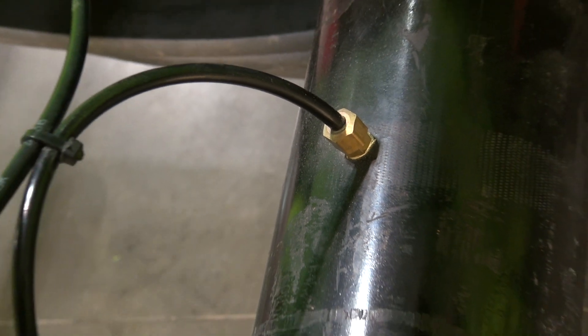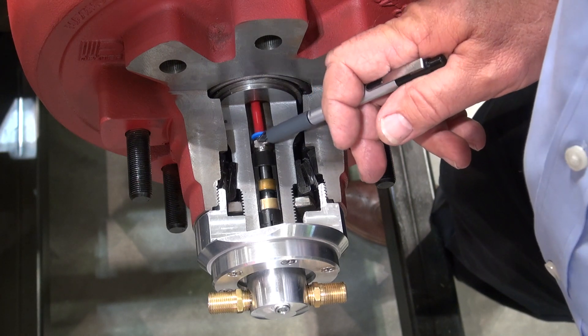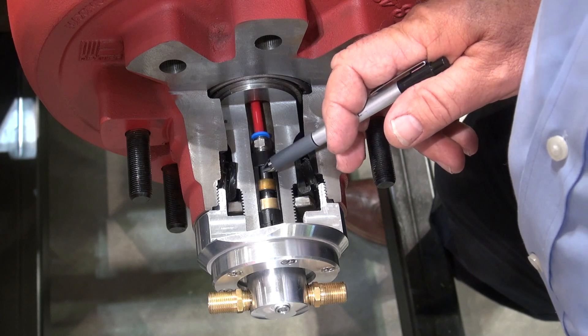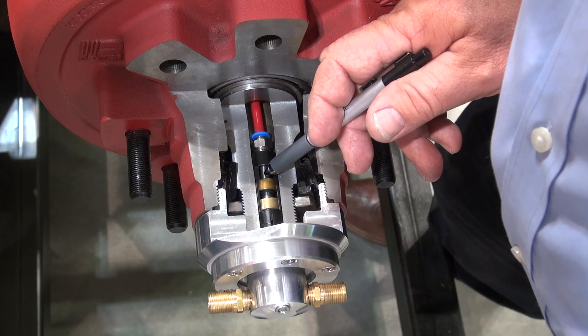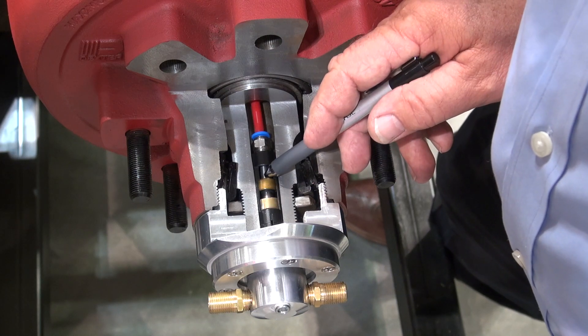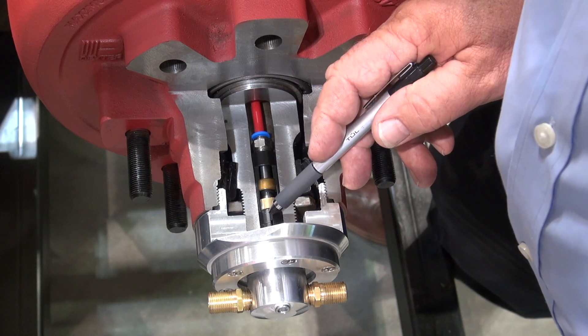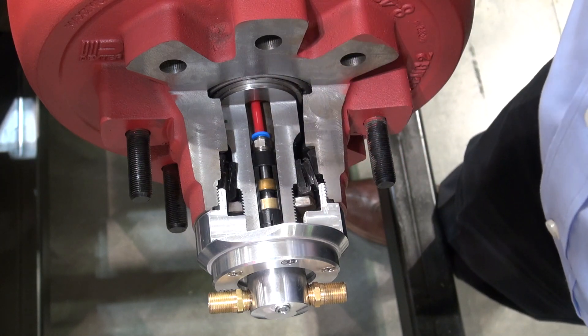That's a fitting design that holds up — they've been on the market for years. We spent a lot of time with push-to-connect companies. This push-to-connect has a bushing in the center and also a lip seal. As it gets cold in the winter, the lip seal still grabs the tubing. Most fittings use an O-ring, but when it gets cold, O-rings don't work — you get leakage. So this is a really good push-to-connect: a bushing in the middle of the tube, a ring on the outside, and a lip seal inside instead of an O-ring. RVs use these in water systems — they use them on everything.